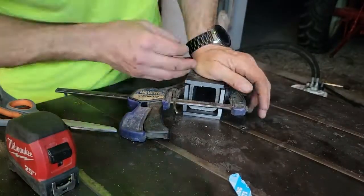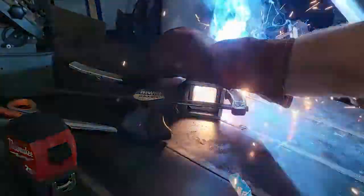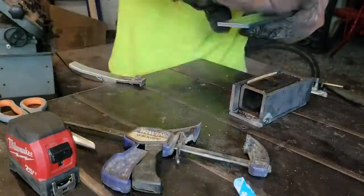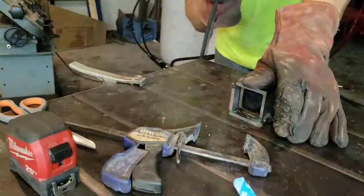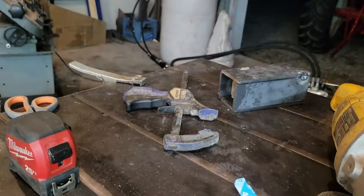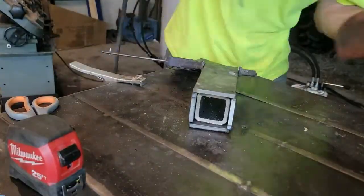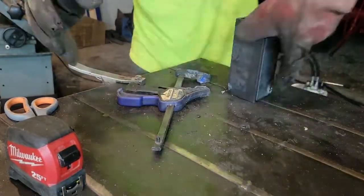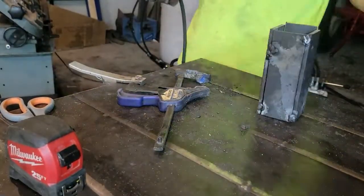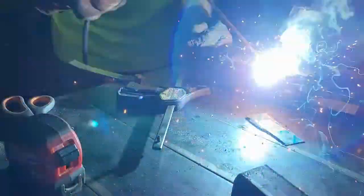Here I'm making a box that will slide along the left-hand side of the three-point hitch frame. That'll allow a hydraulic cylinder to be mounted and will twist the post hole pounder on the X-axis, with the top link handling the Y-axis. I had some trouble getting the shims the right thickness and having it slide freely, so I had to cut it apart and redo it.